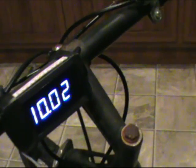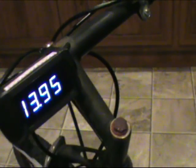Alright, now moving up from our battery bank here, I've got the multimeter set on voltage so that you can see that we're going to be feeding power into the batteries and the voltage is going to go up. Okay, now right now, I'm going to be watching this. Alright, John, you can go to pedaling. I've recruited my son to help me out here just a second. Okay, we're pushing 14 volts right there, and he's pushing the pedal. And what we've got over here, keep pedaling it, John, is we've got 13 volts. Okay, now let's stop, John, and see what we've got.